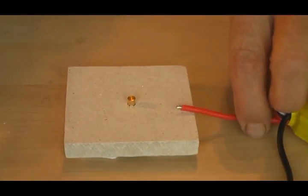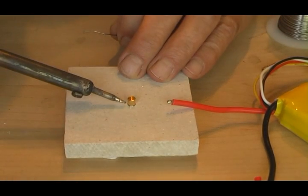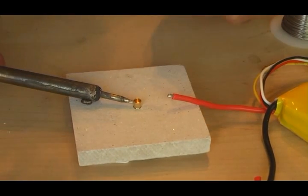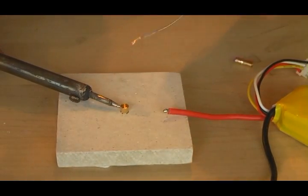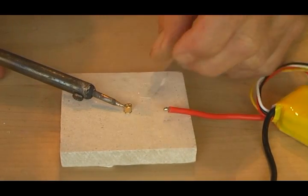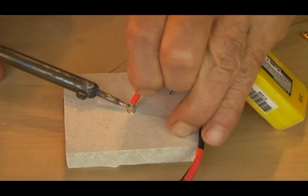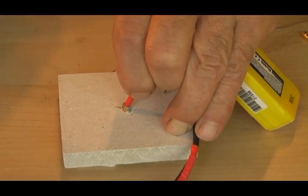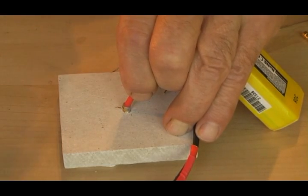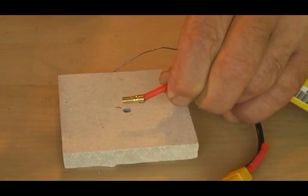Here we are — pin in the heat-resistant block with the wire to be soldered. I wipe the bit of the soldering iron and insert it into the little round hole in the pin, then it starts to heat up and I put some electronic solder into the cup. You can see it going in — there's a nice big pool of it and we can just lower the wire into that. And there we are — we've got a pin on this wire.